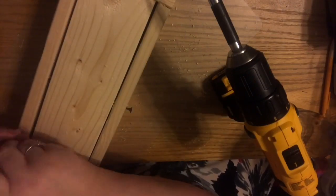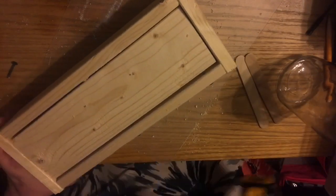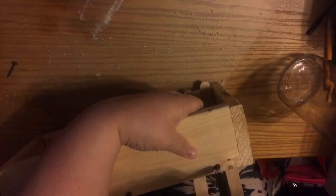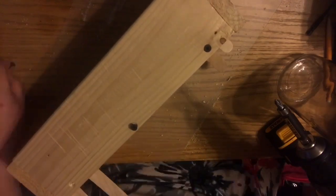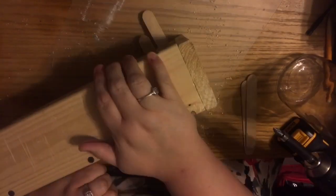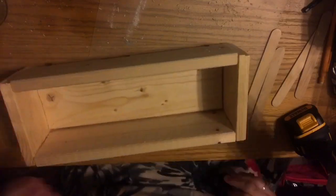I'm checking with the jar and making the adjustments I need, using popsicle sticks as spacers to keep the space open while I screw in — just be careful you don't screw into the spacer. This way the screw is nice and tight and flush to the wood but the space is actually still open. Another good thing about the space in the bottom is it lets crumbs pass through, so it's easy to clean the box out. If you find that the end pieces you put on are affecting how the space fits the jars, you can go ahead and take them off and readjust them.